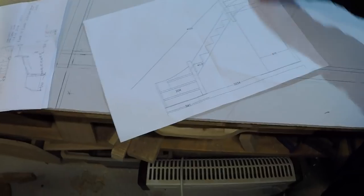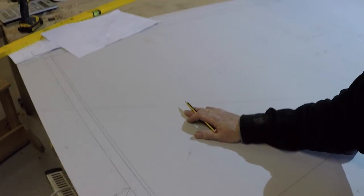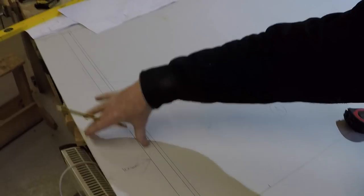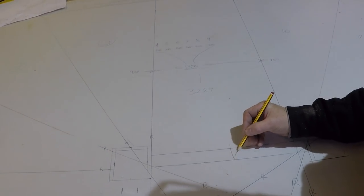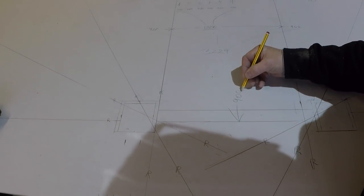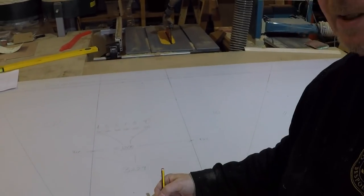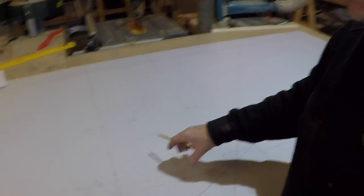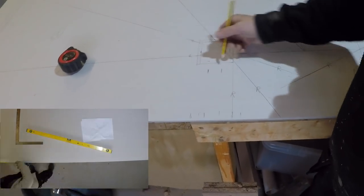Here I am at the workshop and I've just drawn my plan view of the staircase - that's a side view and here's the plan view. I'll set the overhead camera up so you can see me drawing it. Basically I'll mark out - this is a sheet of plasterboard, just handy and made of paper - a 100 millimeter border all the way around three sides. Then I'll mark my stringer size: 900 millimeters is the width of my stair. From there, off my previous line, I'll measure one meter because I know I've got 100 millimeters of border.